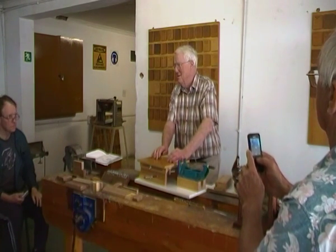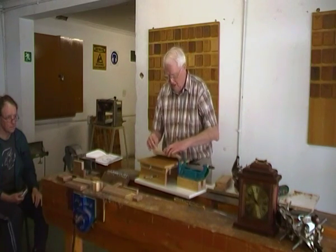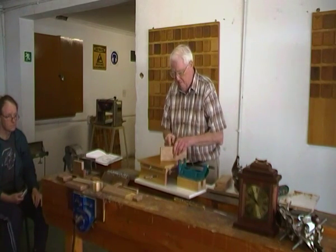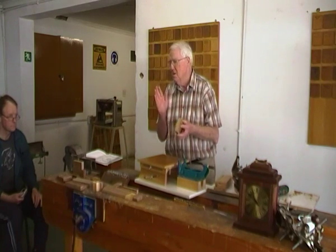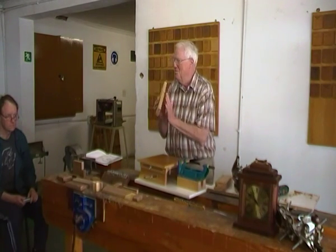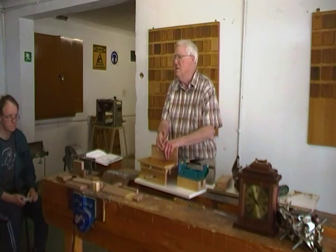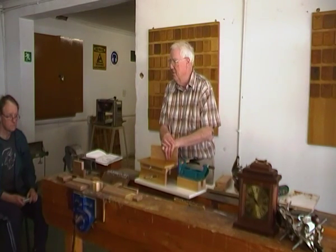So you don't clamp it, you just do it by eye? Yeah. I could clamp the fences, but when you're working with a long plank, I mark my two planks together. And then I set the drill. I always use Brad point bits. I have my line, and then I have a little line there just to guide me straight, so that you're going on straight. And then I always have my face down. Then I know that when I put it together, if the bottom's not 100%, my face is, it always comes short. And it works. It's so easy. I've never had one fail, even with a drilling jig, I had disasters. So this I've never had a failure. It's a simple little piece of equipment and it's really worth the effort to make.